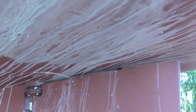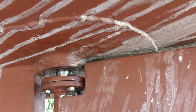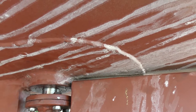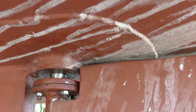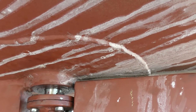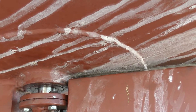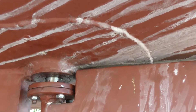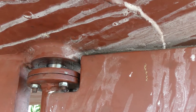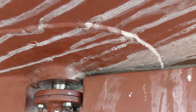Because I had so much trouble getting this bearing out, I cleaned out the inner surface of the rudder tube after I got the bearings out. Then I ran a rotary sanding pad up there to get any rust and any loose debris out, and then I treated it with a bit of anti-rust treatment. Then I smeared it with a little bit of grease and smeared the outside of the bearing with a bit of grease, and it just knocked back in — it took a little bit of tapping, but it went in nice and tight. It's not going to fall out, and it's got a lock screw on the other side anyway, so once it's set up permanently, I'll put the lock screw in there.